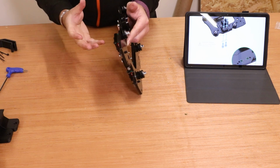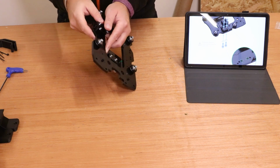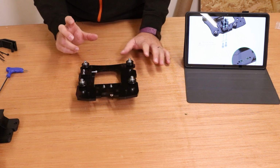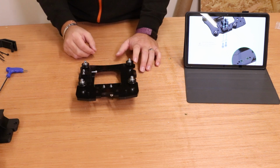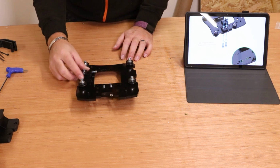One thing I will just quickly mention, if you're not already aware, obviously when you have things like locking washers on these bolts, you don't really need to over tighten them. Obviously you want to apply a bit of pressure, but you don't want to take them too far because it will ultimately start to cause you issues later on. So yeah, pinch them up and then they are good to go.